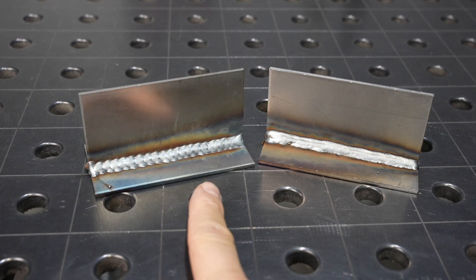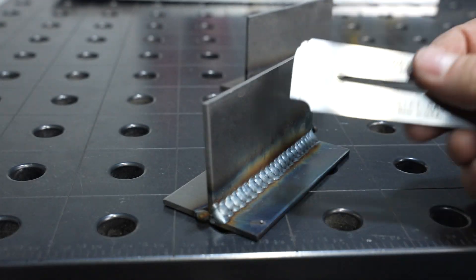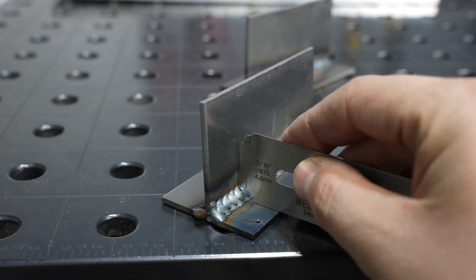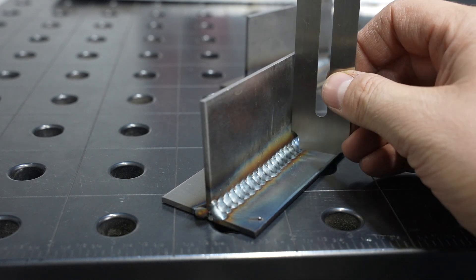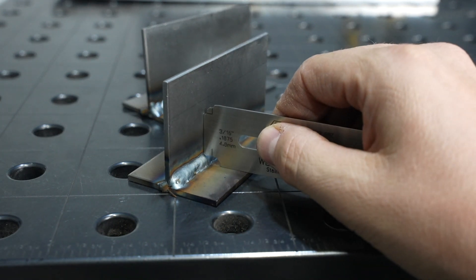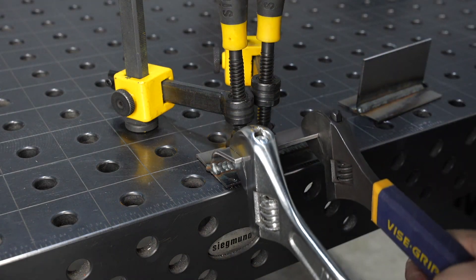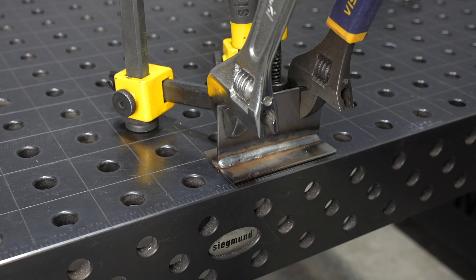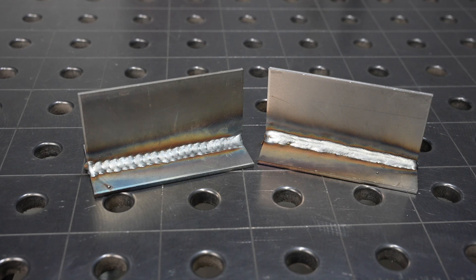Given this range of settings I'd tend towards the high because of this, but are the welds themselves actually equivalent quality? On the left you have a bit more of that rippled appearance; on the right it's a little more smooth. Using a fillet weld gauge, the low-setting weld is right about 3/16 inch on the money, and the high-setting stringer is just a hair smaller than 3/16 inch, but I'd have more confidence in penetration on the straight stringer. In a simple bend test on this eighth-inch material both welds are adequate, but you're going to have less trouble generally with a straight stringer than with large manipulation.